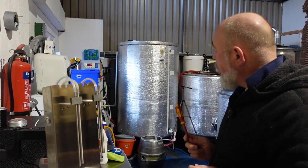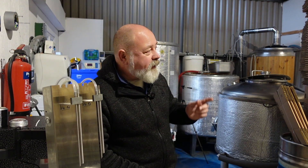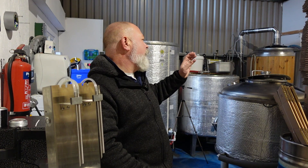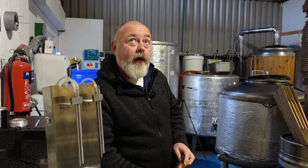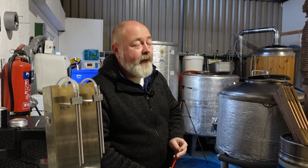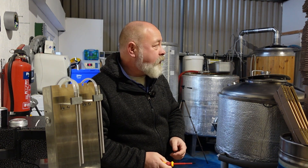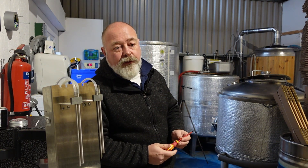The second challenge is everything froze again. For those of you that have watched the videos here before, last year a cold snap happened and I wasn't anticipating it. We didn't have any antifreeze — glycol, we use glycol, it's food safe. We use it in the coolant lines that run around the fermenters to keep the temperature under control, and it froze here. The coolant froze in the lines and burst the copper tube inside the jacket of the fermenter, and I swore I would get some glycol in before the cold snap this year and I didn't. I was away and I think I've burst it again. So what we've got to do is just using water, pump some coolant around the jacket and see if it starts to leak out of the bottom. If it does, then I've got to get the cowling off and replace or repair the pipes inside.